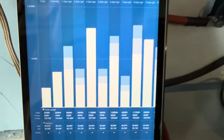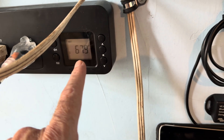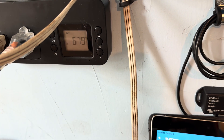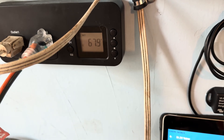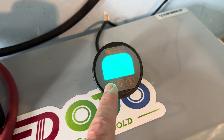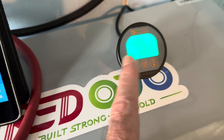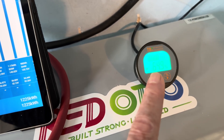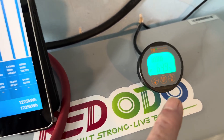I'll need a good sustained burst of sunshine to actually figure that out. And there we go — the freezer just kicked on. It's pulling 67.9 watts, and that's about normal for that 5 cubic foot freezer. It's just a freezer only, kind of a backup freezer. We've had very cool nights lately so it's not even running that hard at all. Pretty good shape. Even if I caught no more sun — and you can see now we're actually pulling more than we're putting in with that arrow going down — even if I saw no more today, that's fine. It seems to fluctuate between about 40% and 60% under these conditions day in and day out. Looking good.